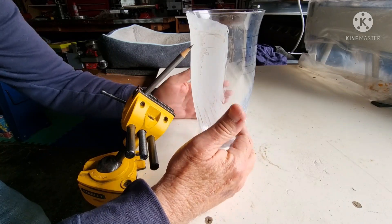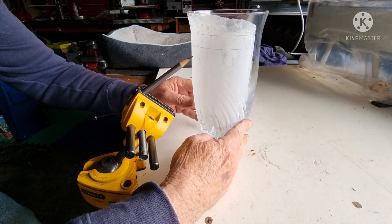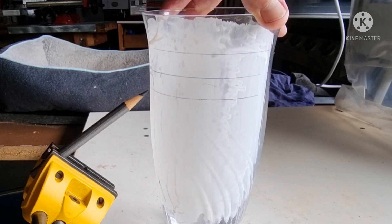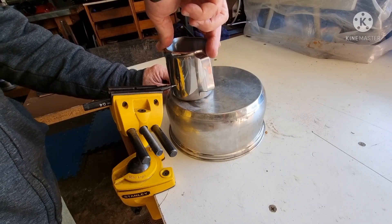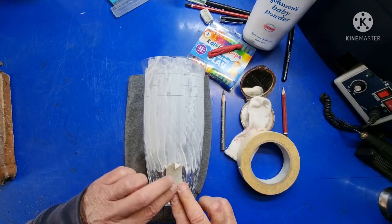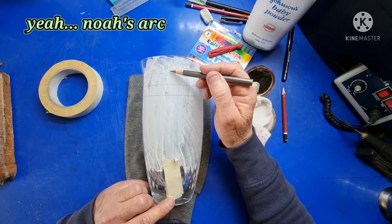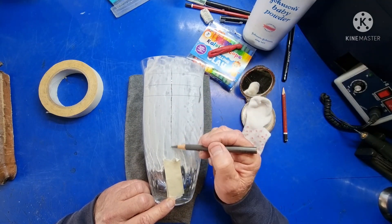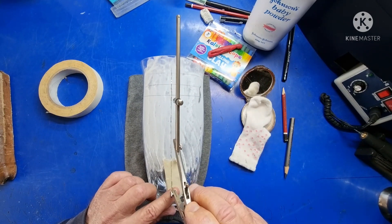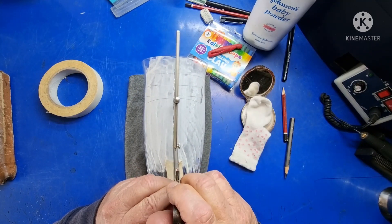The mini vice is great for low items, but my main method for many years is to use a swivel vice — any will do, as long as you can point the pin over the table. For low items, just prop them up a bit higher. All engravers avoid arcs where possible, but if the customer is insistent we've got to figure out ways to do it. On a silver-plated or slippery surface, I put three coats of tape — any tape — so I've got an anchor for the compass.